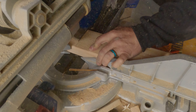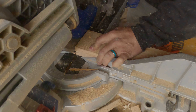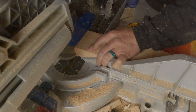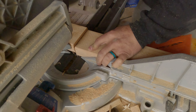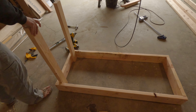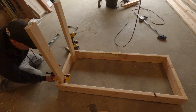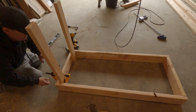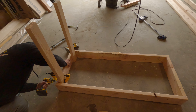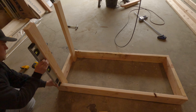Since I'm using a pre-made cabinet door and cabinet face frame, I had to get the height perfect. For a few cuts there, you definitely saw that my saw was off. Even though it was zeroed out, I didn't take the time to put a square against the fence. What ended up happening is I was slightly off and I had to go back and recut all of those pieces because I didn't take the time initially to make sure that my saw was square.